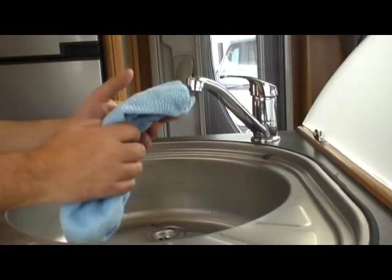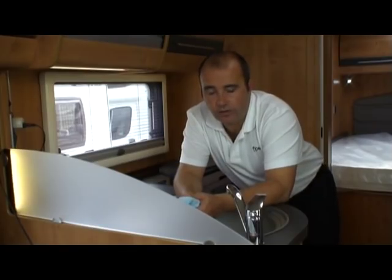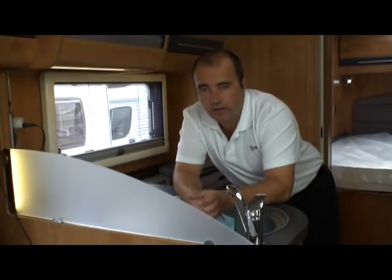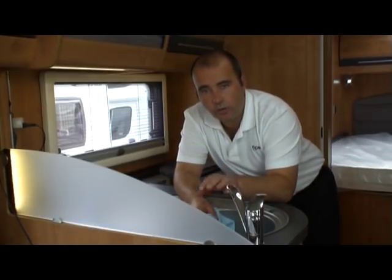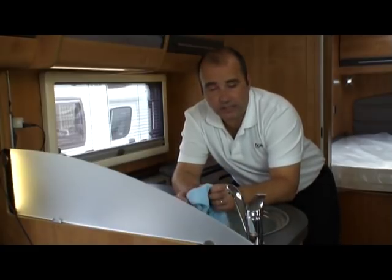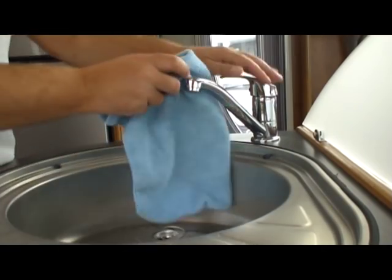So, what I would recommend is that you carry a little cloth so that you can hold it over the front of the tap, because remember that the air is actually chasing the water out. So, whenever all the water comes out of this particular pipe, there will be quite a large spit, and it basically just stops the water from splashing around. So let's do that now.